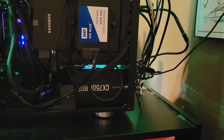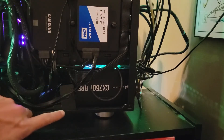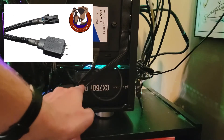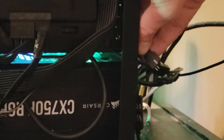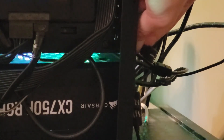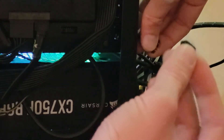We're back inside. We're looking at the side of my Corsair PC. Here's one of my lighting node pros — I have another one off the side of the screen. This is what I have — one of those adapters. It goes from here out here, and if you can see when I pull on it, it just disconnected. So this connector — and I'll try to zoom in here — there's our connector, and that's just so if I had to move the PC or do anything, I don't have to worry about moving all the wires. Let's bring a new cable over — our arrows are on the bottom side. And we'll double check that the cable works. And voila — we got light! And it's really bright, sorry about that. But our cable we just made is working.